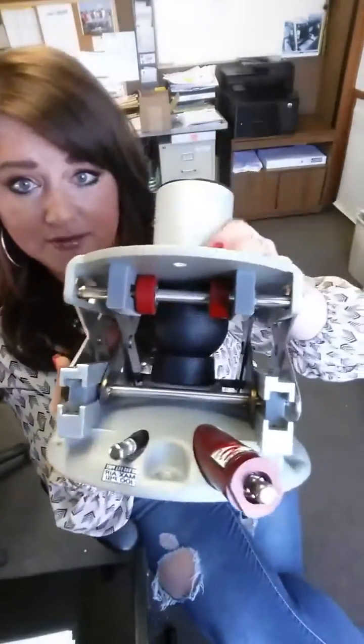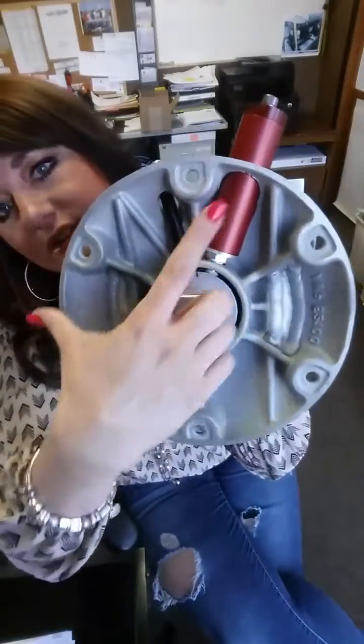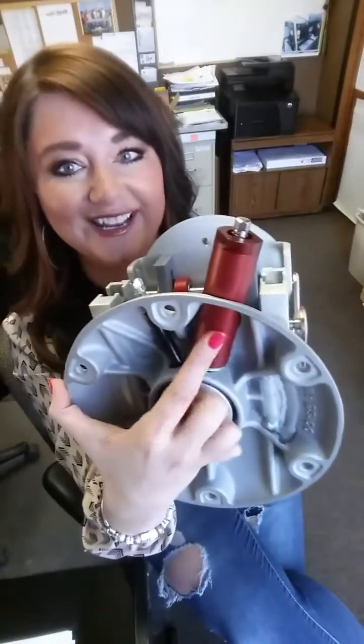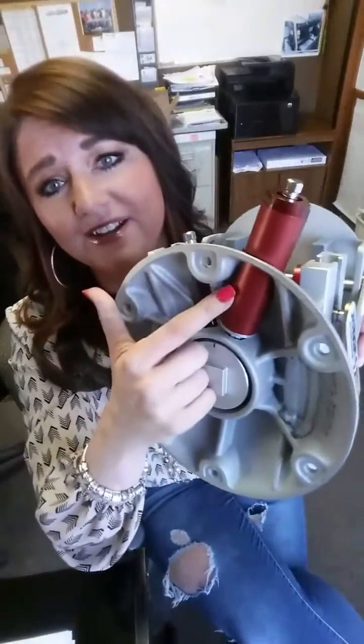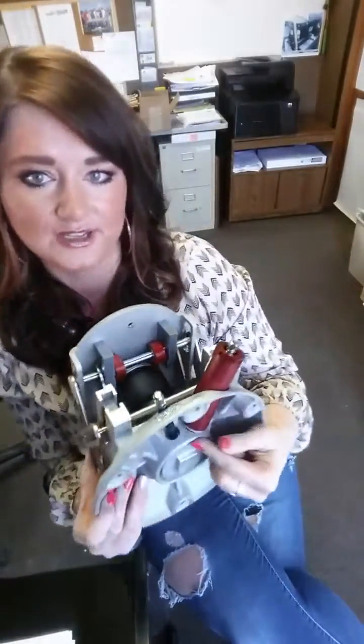Then that air has to go somewhere — pushes it down, pushes it right into this manifold right here. Then it goes into this accumulator tube. This is where the magic happens. This is what gets me excited, why I keep coming to work every day and I passionately tell everybody, Airwave Pedestal, it really is the real deal. The air goes in here and then instead of just letting it go just as fast as it comes down, it's all regulated. There's a tiny little orifice in here and it's all controlled. So there's none of this — go down super fast, there's no eject feeling, there's no feeling like you're getting catapulted out the side of your boat.